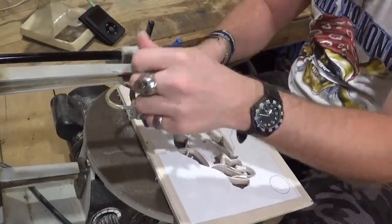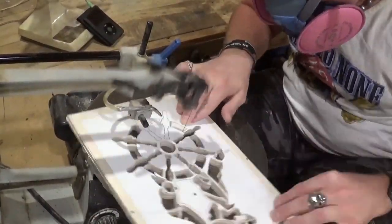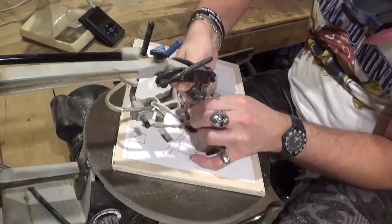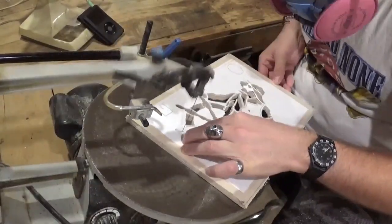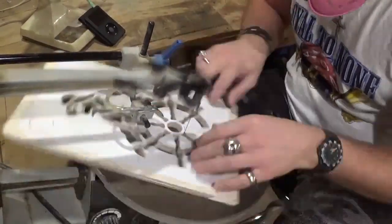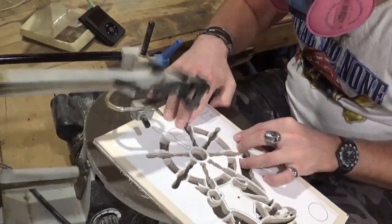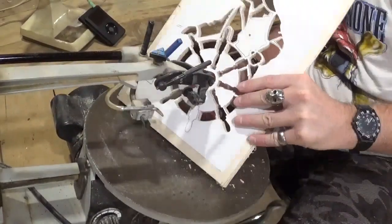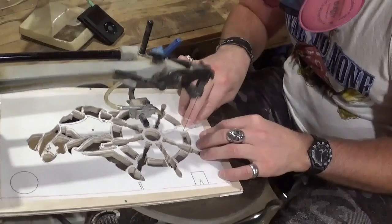Just working our way down toward the ship's wheel at the bottom of the pattern. For the very last internal cut — or next to last — you will see it has a nail through the two sheets of quarter inch plywood, and that's just to hold and lock the two pieces together to keep them from moving and vibrating apart. You will also see the little brad nails around the outside of the wood to hold everything together and keep it stable when stack cutting.